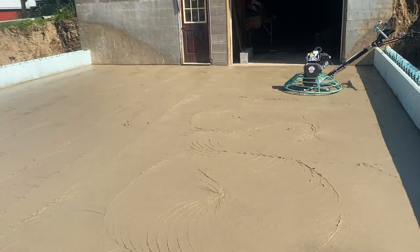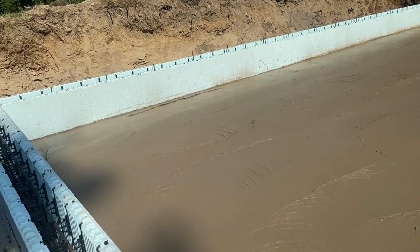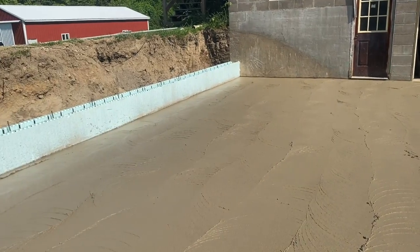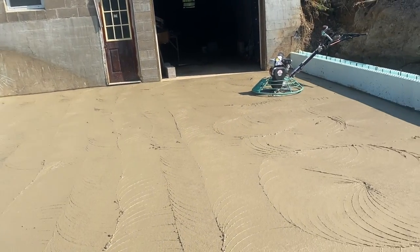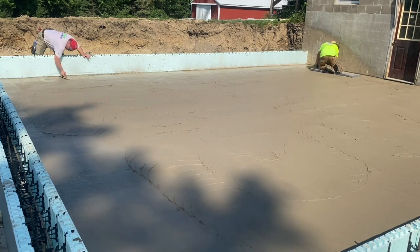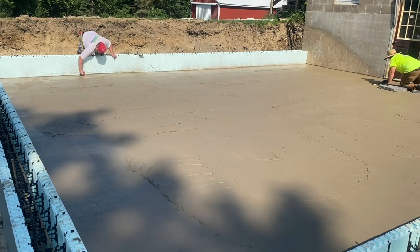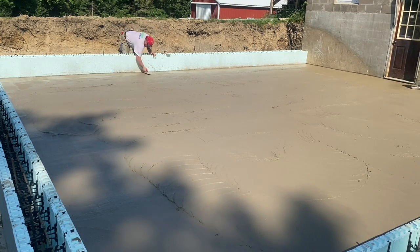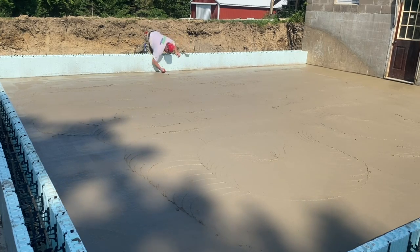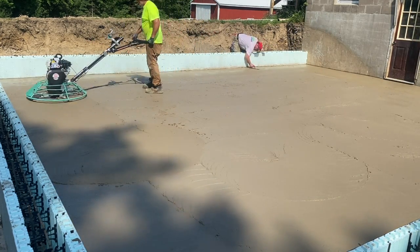She's still a little soft, but I hit it trying to flatten things out a little bit. Like I told you, we edged it right off the side here — you just reach over and it makes it nice and easy. We can continue to edge this from outside on each pass, makes life so much easier. We'll let her stiffen up a little bit more and then we'll hit it again. You can see Bronco reaching right over the edge and edging that — how easy that is to do. I'm on the kneeboards for just the one spot I couldn't reach. I just used some foam boards — a couple pieces of polystyrene — that's what I like to kneel on.